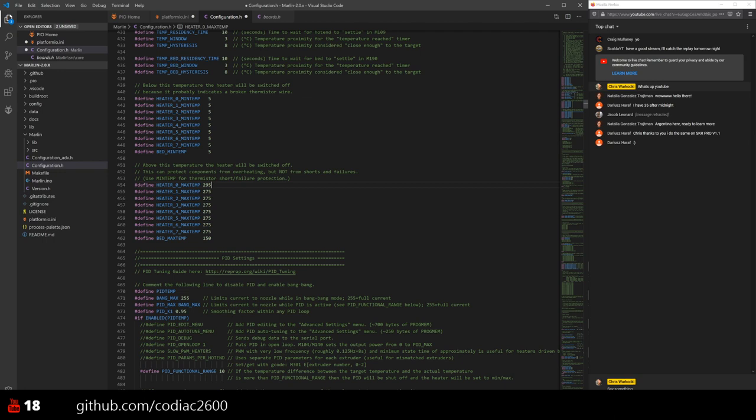Remember, technically our max is lower than that, at least sustained. The Mark 3S uses a standard E3D V6 with an aluminum block. The aluminum block is only rated to 275C max print temperature. It can heat up higher, but there's not a long sustain. So if you're printing above 275 for a long time, switch to the copper block, because that aluminum will expand and get soft, and you'll most likely ruin the threads on it. Our max bed temp is actually 120C.